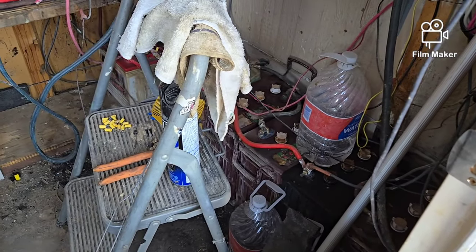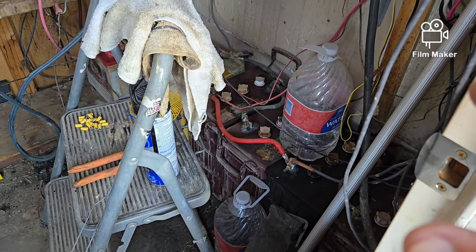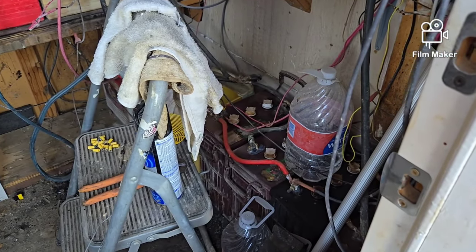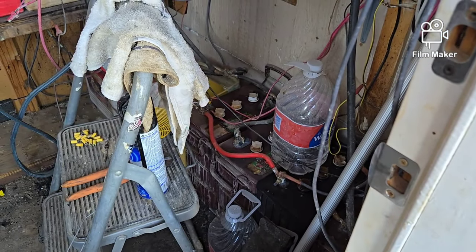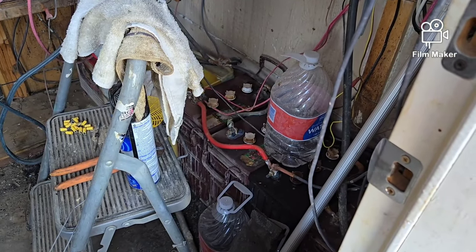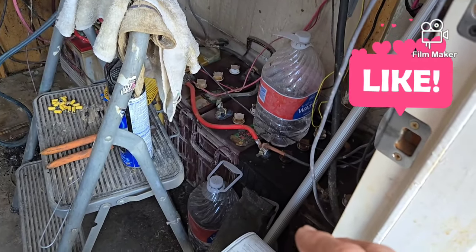What I'm going to do is just make a modification — I'll put the shelf in, put the batteries on the shelf, and then I'll work on building an insulated cover around the batteries underneath the unit so that it keeps them warm in the winter. I don't think I'll have a problem because the really extreme cold weather is usually overnight and the batteries won't be charging overnight anyway. If the BMS shuts them down from being charged, there's no big deal — by the time I get up in the morning, the sun is already out and the temperature outside is already in the 60s.